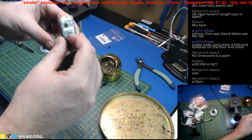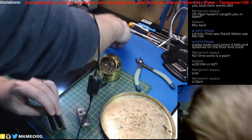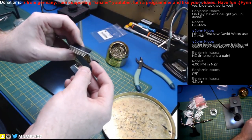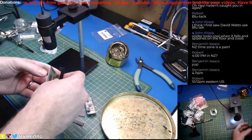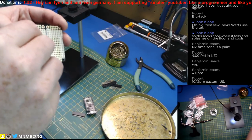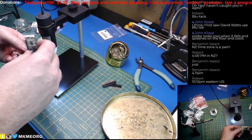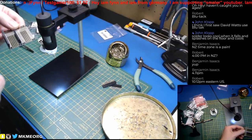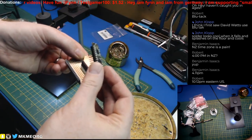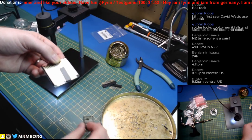So these extend through — wait, I've got two sets of headers, one shorty one longy. We don't need them extending through for this — we can use the shorties, because we're not going to put this proto board into a breadboard. RX/TX — yeah, they don't break those out. SDA, SCL — yeah, that makes sense. Alright, let's solder it up.